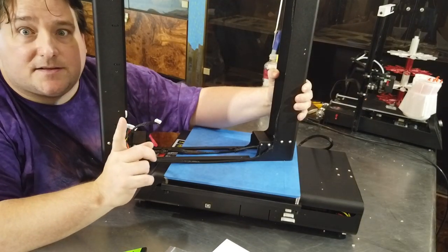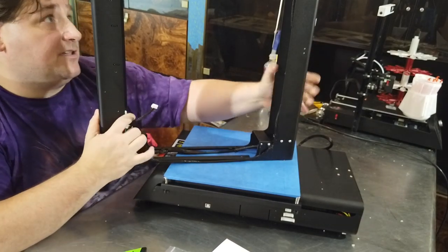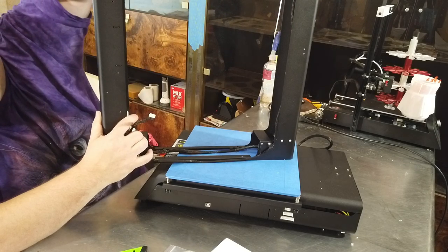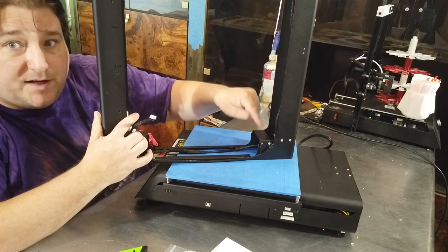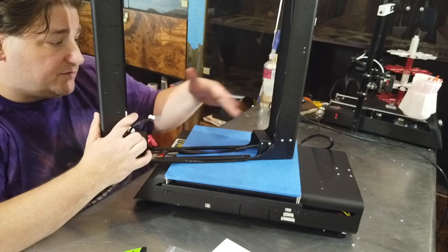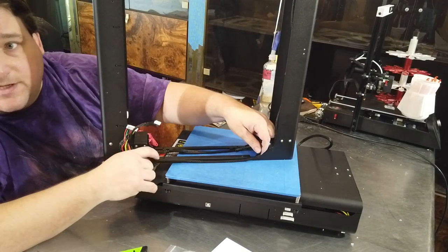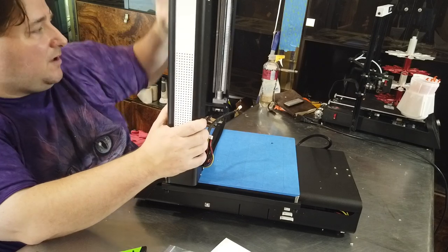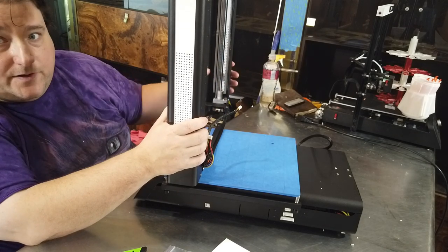This is the A5S, which is an upgraded version of the A5 that I already have. The hot end is upgraded — it uses more standardized components, a standard blower. It's got a more open filament drive system here for the feeder unit, open and standardized — you can replace that with standardized parts. They also improved the connection to the base unit. It used to be just four bolts, but now they've added these little 90-degree brackets, and two screws also screw into the sides, which will make this entire assembly flex a lot less while the printer's in use. Because while this is a very strong, well-built system, it is just stamped sheet metal and it will flex. This removes a lot of that flex — very, very good upgrade.